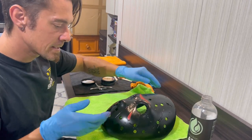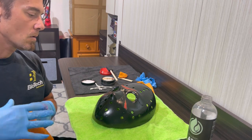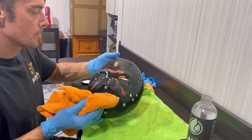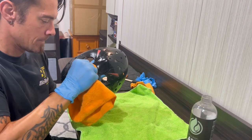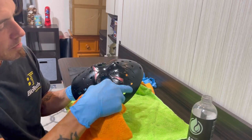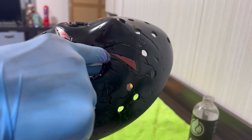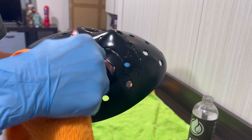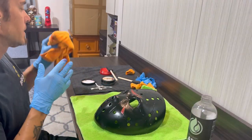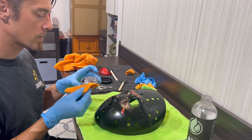Now that it's on there and cleaned up, we want to introduce a little bit of agitation and force. I'm going to take off some of the excess wax and use heat and pressure to work it in. I grab a fresh microfiber towel, rub this in — it's going to take off any excess and work it into the pores. There's a little bit of smudging here from where I used the mineral spirits — you just rub around there and it takes it right off. So that's pretty good — then we're going to do the same thing with the silver. I like this stuff because it's not as watery as Rub and Buff, which can be a bit weird to mix up.